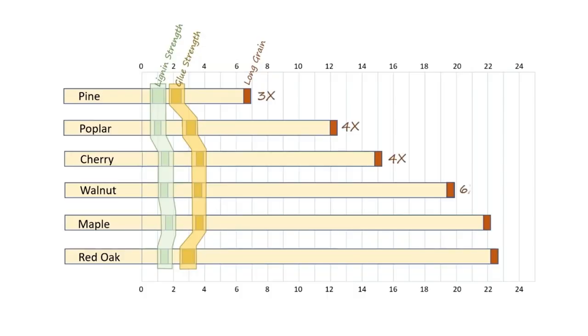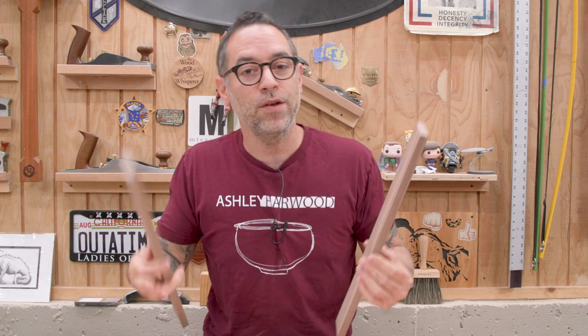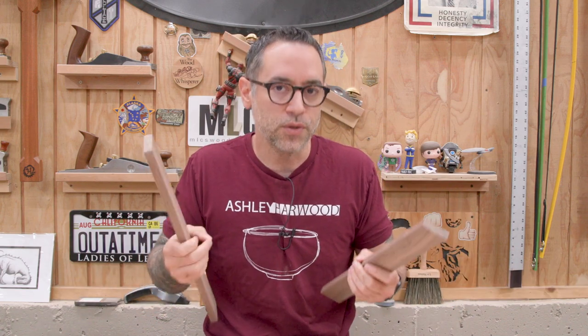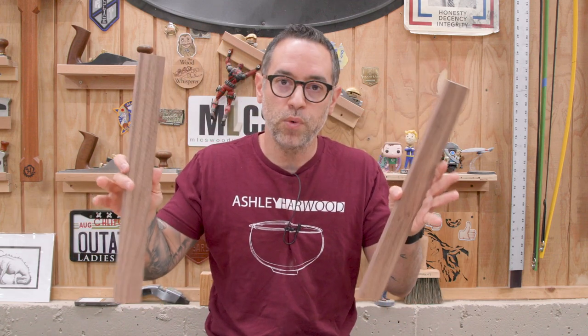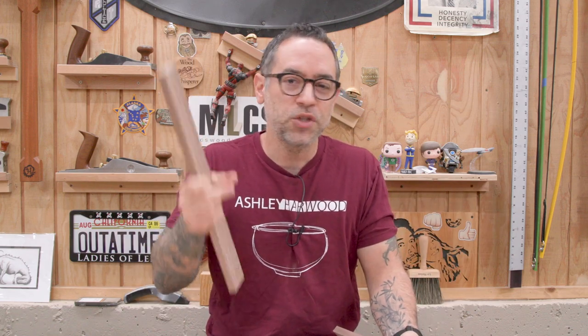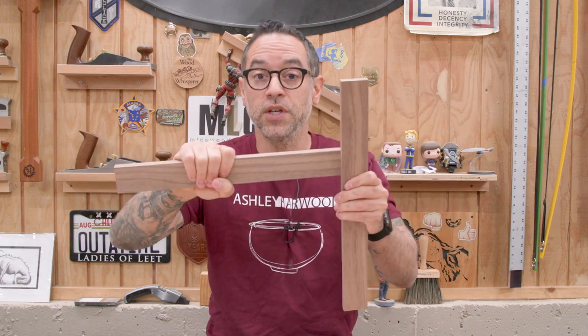Those red boxes at the far end show the force it took to simply break a board itself — completely fracturing the long grain, like bending it over your knee. When we create interlocking wood joinery, we're not really concerned about which glue surface is touching which other surface. The joint itself is where all the strength comes from. Our goal is to have two pieces intersect in a way that takes advantage of the strength of both boards. The glue just becomes the thing that prevents it from being pulled apart — it can add some strength, but it's a drop in the bucket compared to the mechanical strength of the joint when the two pieces interlock.